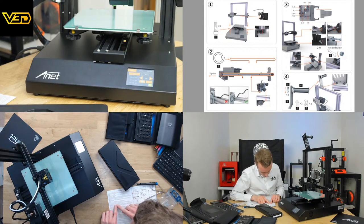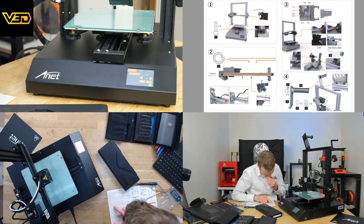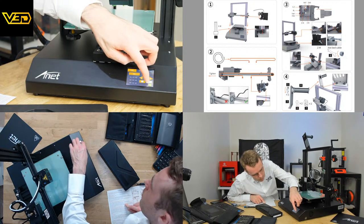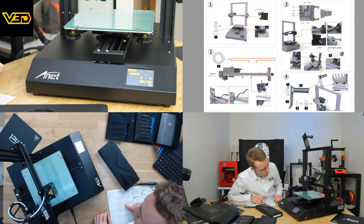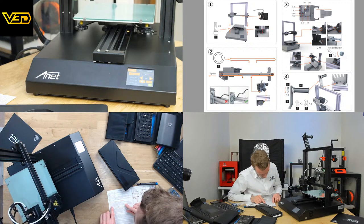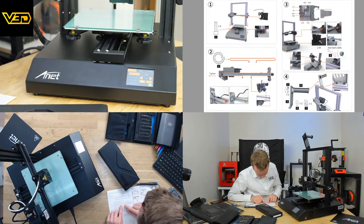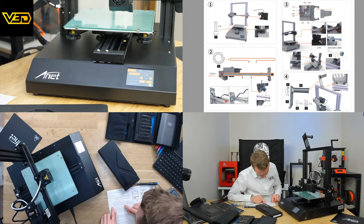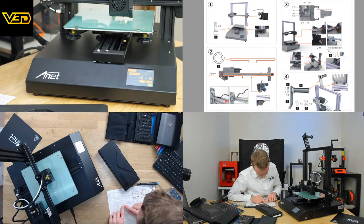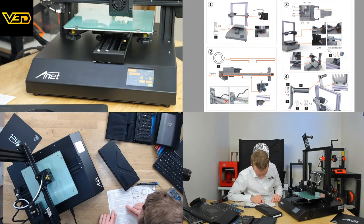Click on the OK key on the pop-up interface to end the leveling. Click the OK key on the leveling interface to check the distance between the nozzle and the platform, which should be exactly the thickness of a piece of A4 paper. If you set minus value, the nozzle will begin printing close to the build plate. If you set plus, the nozzle will begin printing farther from the build plate. Click OK to save the value.